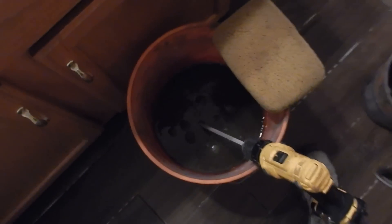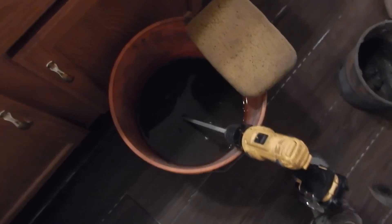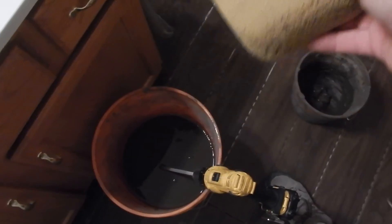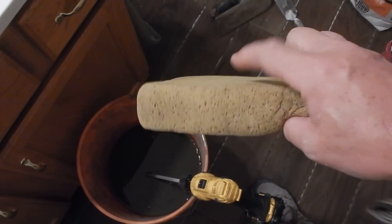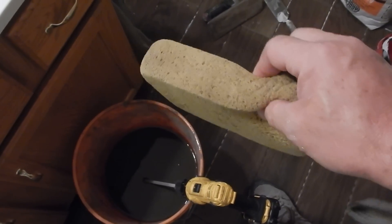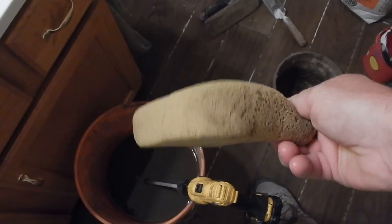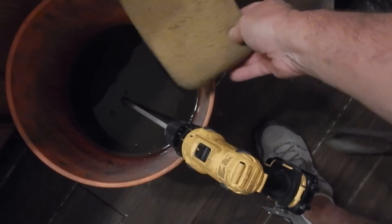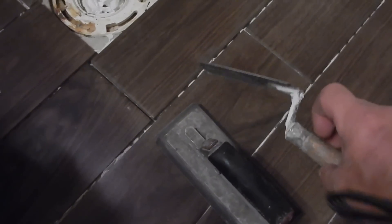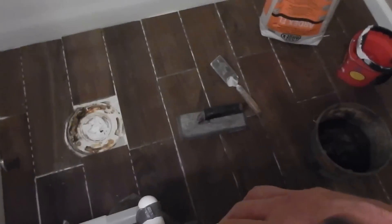It's important to make sure you get your tools clean so that the next time you need to use them they're ready. I've got a sponge, and once I use this on grout I'm not going to want to use it on my car, because there will be small pieces of sand and it'll scratch the finish. So once you start using a sponge for grouting, that's where it needs to stay. I've also got my float, which I'll use as my trowel to push the grout into the spaces between the tiles, and my margin trowel to scoop out the grout.